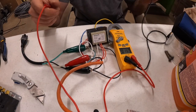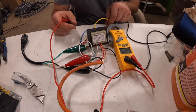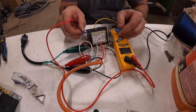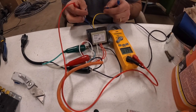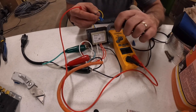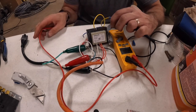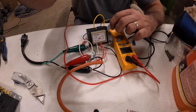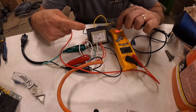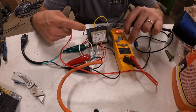To provide the secondary with 24 volts — the secondary on this is 24 volts. The yellow wire in this case is going to be the hot. I've already put some spade connectors on here. Put one probe on each terminal — you can disconnect these to measure — and we're getting 28 volts, which is okay in this case.